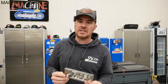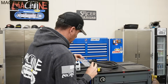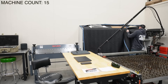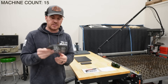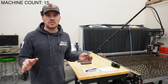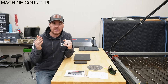This is a piece of 18-gauge stainless cut on the MetalFab, and you can see this thing's pretty small — just shy of 7 inches — and you can clearly see the detail. Pretty unreal, and there is almost no dross. I have a direct example: this was something I did for a retired Chicago detective. They have a certain logo and the detail was so small I could not cut it on my plasma table. So this is 14-gauge mild steel and I had to sub this out to a fiber laser cutter — a pretty large one, probably a million-dollar machine. But you can see the detail. Way too small for my CNC plasma cutter. Hopefully that puts it all in perspective — the difference between a plasma cutter and a fiber laser is night and day.